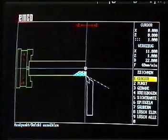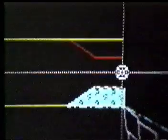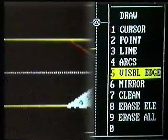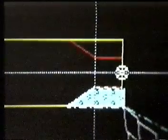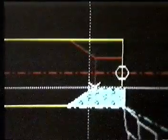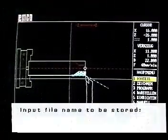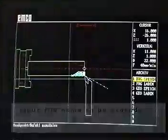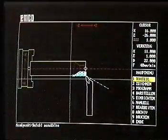In the drawing menu, there is also a command mirroring under F6. After activation of the key, the screen mirrors the entire contour as it really looks. With the command visible edges, we can give our design so-called visible edges. We move the cursor near the visible edge points, acknowledge with the key F5, and the visible edge is automatically drawn — very simple. In order to store the written program, we go to the menu point Archive and store this program under F1. Everyone says it sounds easy, but is it really that simple? Yes, we can try it out.